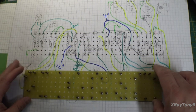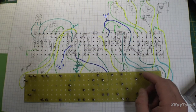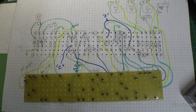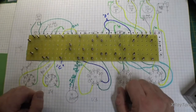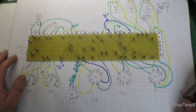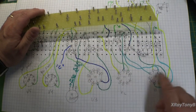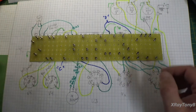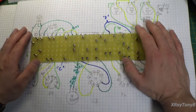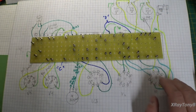I did make one mistake — there was one extra pin. But if that's the only mistake I make, I'm pretty happy with that. The next thing is to get all the small components — resistors and small capacitors — and populate this board. We'll do it all right here on the bench before we mount anything down. Then the amp will be pretty much built, and all we have to do is run wires from the tag board onto the sockets and pots. This is a little out of sequence from how I normally build amps, but this is a new process for me. I'm learning and experimenting, and if this works out, I think it'll be a really good way to do it.